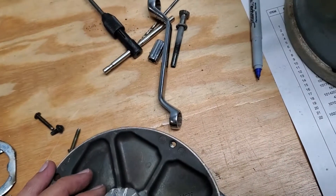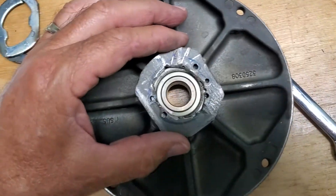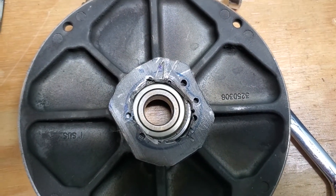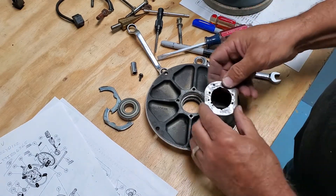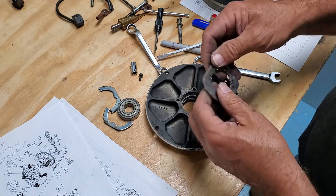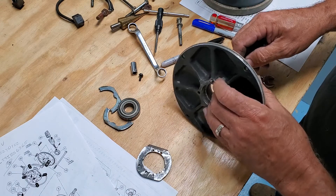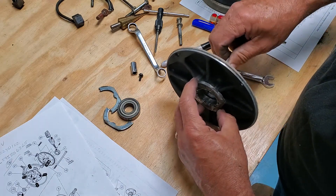This is a piece I'm making. I know it's really ugly right now, and it's going to stay ugly. My holes will be lined up about like this. I'll trim it back to where it's just touching the bearing outer ring. I took those little burrs off — most of the burrs. There's a little burr right there. I wanted to make sure I had it sitting flat and I didn't want any burrs from when I was grinding the outside edges to keep it from sitting flat. So I'm going to put a screw back in — get this screw started.